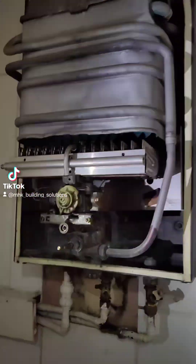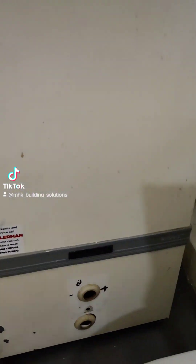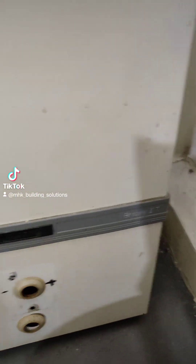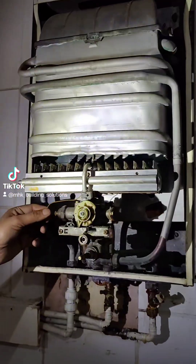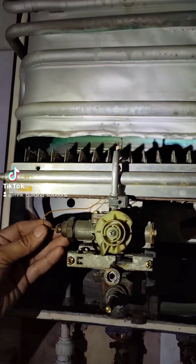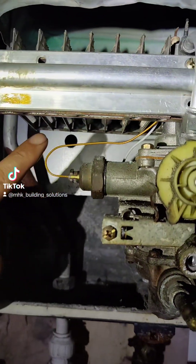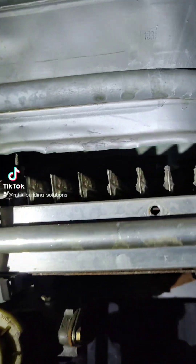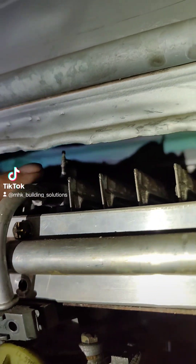It's a Brittany 2T water heater. Let's have a look at the cover on it. The fault on this is that the thermocouple is faulty - it's not holding flame. The thermocouple on this is connected into this gas valve section and then it runs up and comes out of the pilot hole assembly just in there.